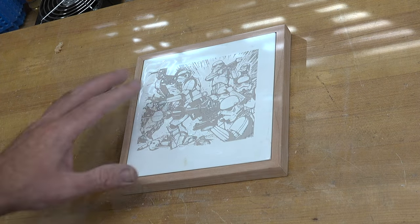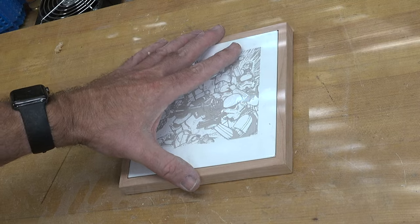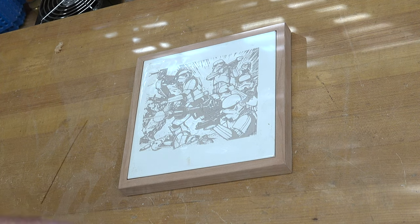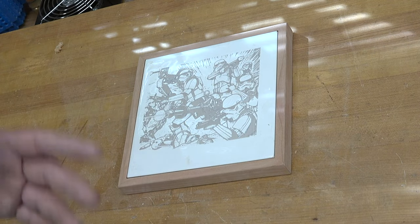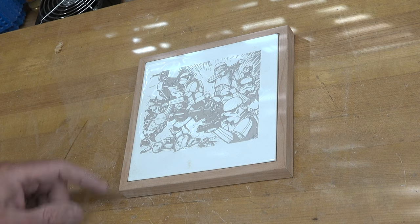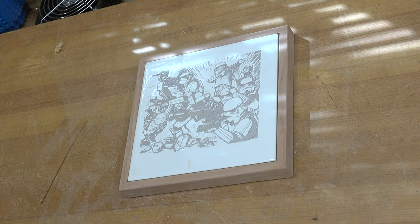For me this cherry is going to get some satin finish varnish, and I'll be using the HVLP sprayer. I don't do the setup for every little project, so things that need finishing I do in batches. When I get three or four projects lined up ready for a finish, I set up my spray booth and go to town finishing all of my pieces.